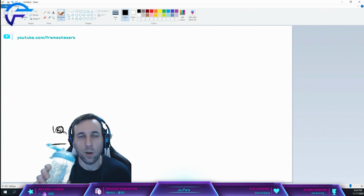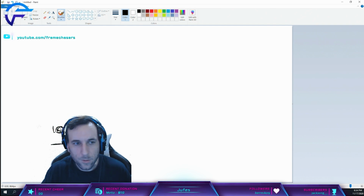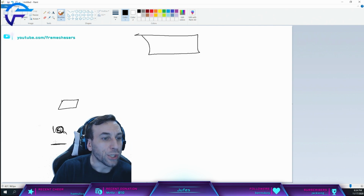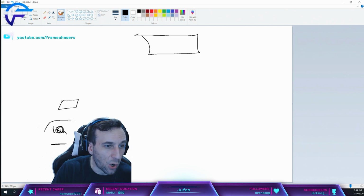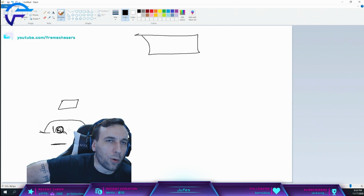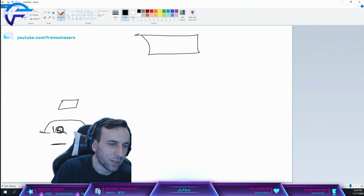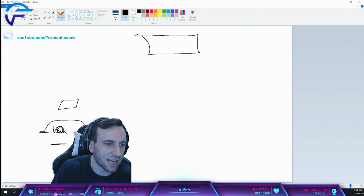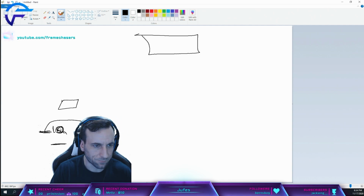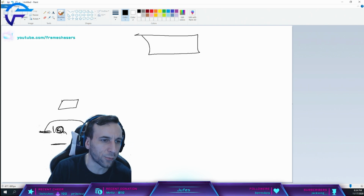So all you gotta do, you do the double shunt, you do the single shunt down here, you glue a wire over top of the 10 amp fuse to bypass the fuse so it doesn't blow it. Now, some people might be like, hey, isn't that dangerous? The fuse is there for a reason. No, we've been living for decades without fuses on our boards. It's fine. The fuse is not there for any other reason but to blow up if you're drawing more power than you're supposed to, right?